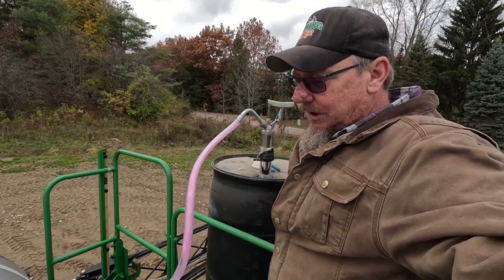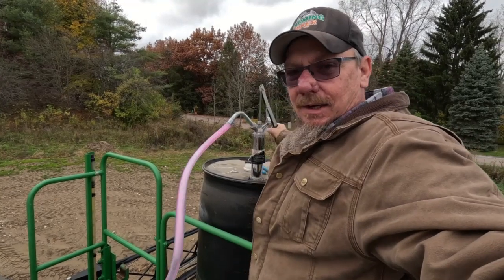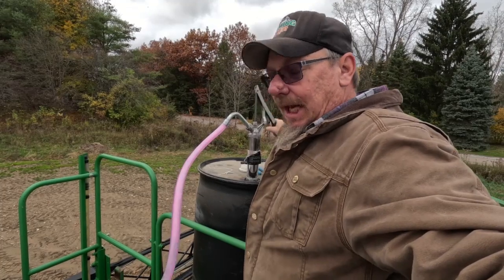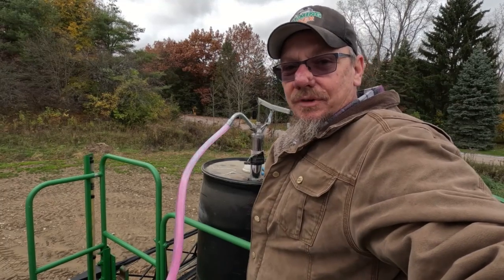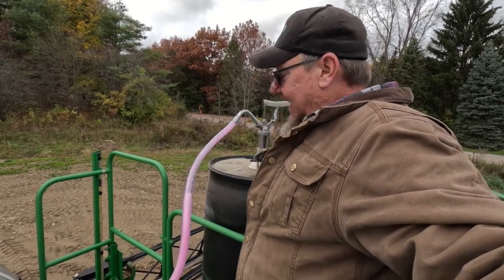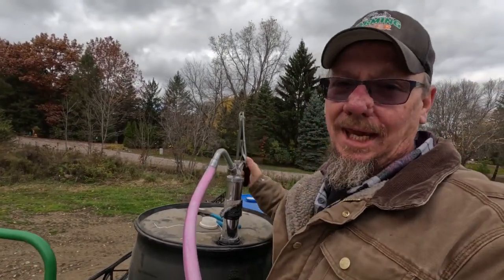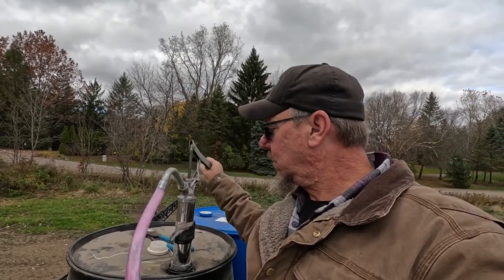So what I've gotten done so far: I was able to drain the booms and get all the screens and everything out, and got those cleaned up. Now I'm pumping about 30 to 35 gallons of antifreeze into the tank, then I hit the circulating pump which circulates it through all the hoses. This is the part that takes the longest because you've got to hand-pump it — we're too cheap to buy a pneumatic pump — so we're gonna pump away.